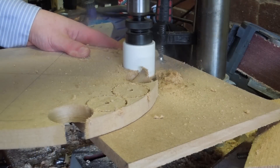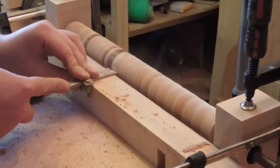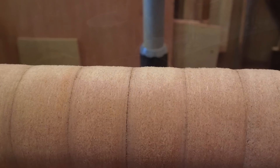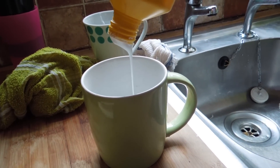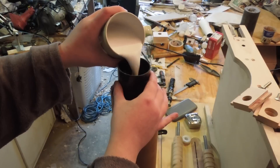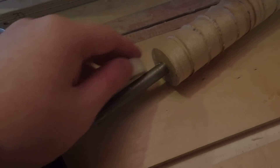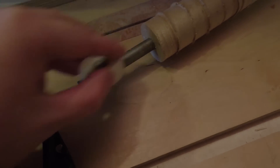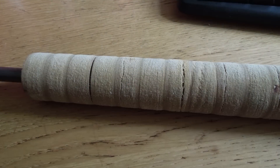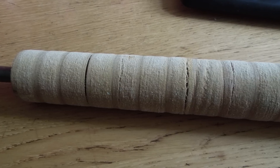The first attempt for the rollers was making them out of MDF. This left an undulated surface that I couldn't get smooth. The second idea was to soak the MDF in something to harden it. Diluted varnish might have worked but it would have taken a long time to dry and smelled awful. So I tried diluted PVA glue and dried it on the radiator — I'm glad I thought to wax the metal since it heavily rusted where it wasn't protected. This didn't work though; the MDF cracked a lot as it dried and it didn't do anything to make it turn better.